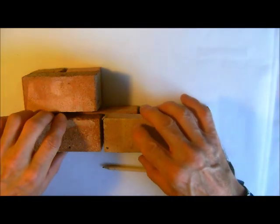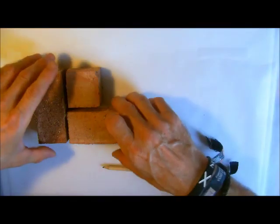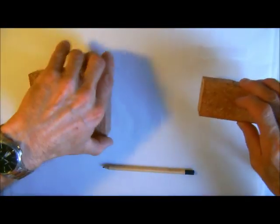So it's quicker to build and it looks good. We do have this problem here which we would normally put a cavity tie across, or a cavity tie bent round, just to tie across that straight joint. So that's how we build nowadays. But years ago they did do it properly, and what we are going to have a look at now is an end pier.